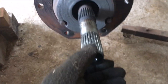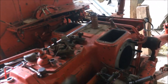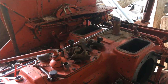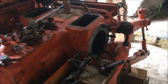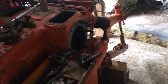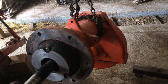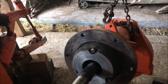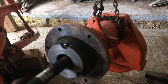I'm not feeling quite so bad now. The fact that someone had to redo the brakes on the other side means that the brakes on this side were probably getting pretty close to needing replacement anyway. Having to pull the final drive off to do a brake job — it's not as easy as a lot of other tractors. But if someone has owned WD-45s or D-17s like I have, we kind of understand that this is just the nature of the beast.